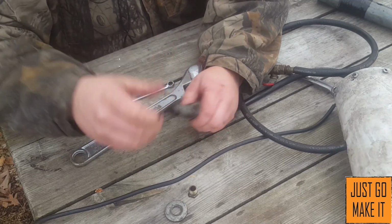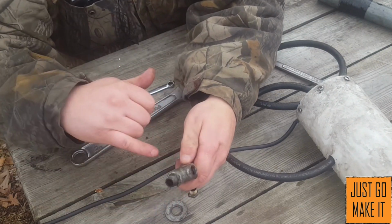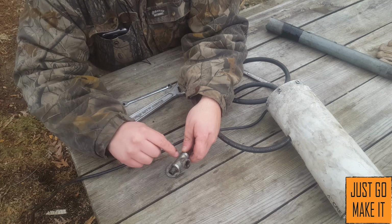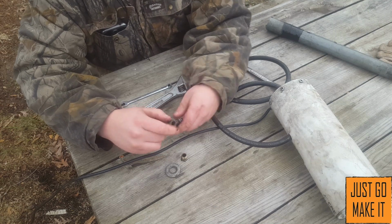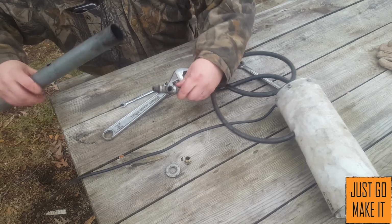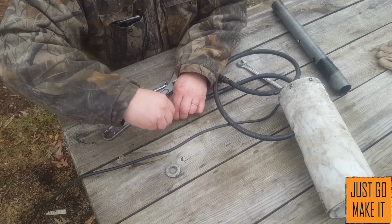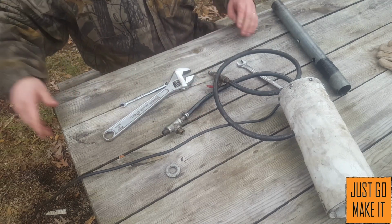And with this screwed in here, and the oil coming in here with that tip actually centered inside down there, it makes a siphon feed. So the back side of this fitting is actually under low pressure, so it will pull the oil down into it and blow it out. And it blows it out in a fairly fine mist. I will demonstrate that as soon as I get things back lined out. We will leave this out and I'll show you how well it blows. So, back over to the foundry.